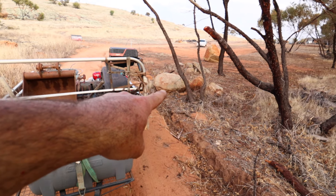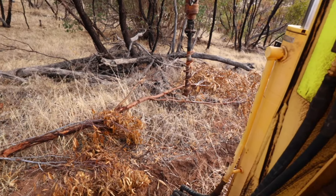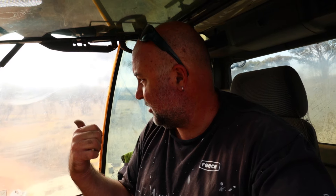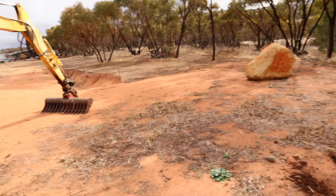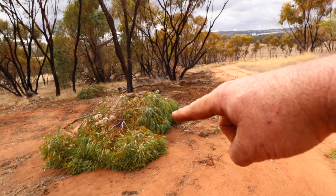The fence is going to run around the outside of this post — it'll come down here and then along that way. So I want this post leaning out just a smidge so when I pull it tight it'll pull back in. We also have other steel posts coming off at an angle that go down to the ground and get tied back into this post. I'm doing my own little take on that system because it works out cheaper since I can make the stuff here — true Rockpile fashion.